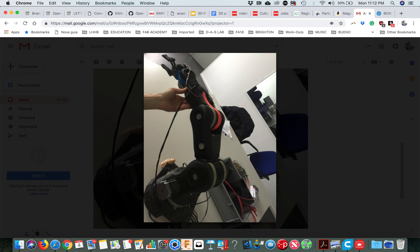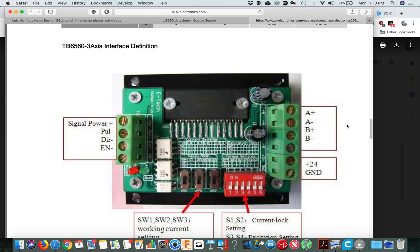There are spaces on the RAMPS for stepper motor drivers. Have a look at the RAMPS documentation — just search 'RAMPS 1.4 pinout' on Google and you're going to find nice pinout maps where you can see which pin is pulse, which is direction, and which is enable.